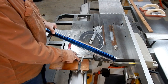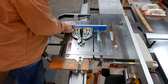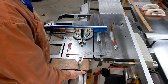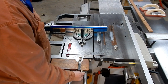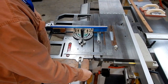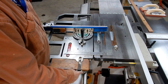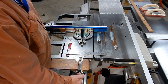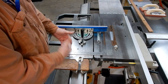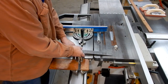You needed additional support beyond what's right here at the table, so angle iron supports had to be installed on here with a plate coming across. The adjustment stays where it is — once you adjust this out you can leave one side firm, so when you put this in it's always up against the stop nut, and then you just back the other one off when you take it on and off. That makes it quick, easy, and repeatable.